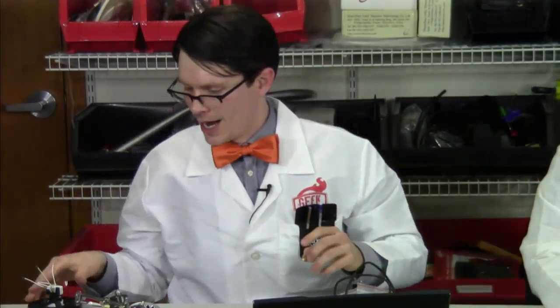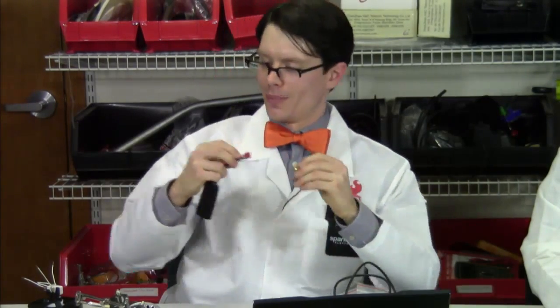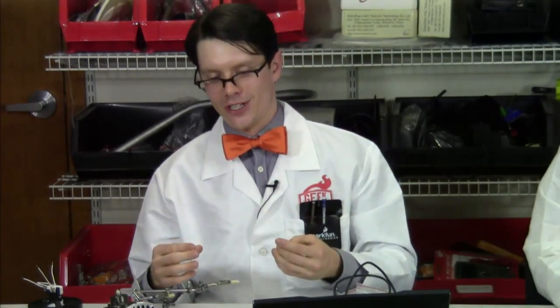Let's begin to hook this up. First I'm going to use one of these male Dean connectors — that's going to be hooked up to the battery. The batteries we sell come with these and they will mate together. They are polarized so the horizontal pins are the plus and the vertical pins are your minus or ground. I'm going to be attaching two wires to each of these using hooks like we did before — one set going to the Arduino to provide power, the other set going to the car horn to provide lots of current.